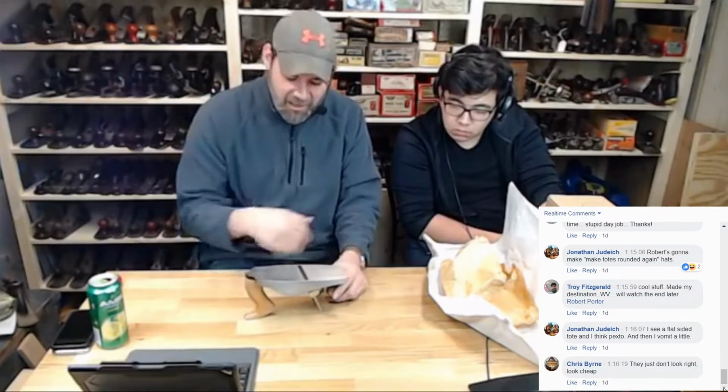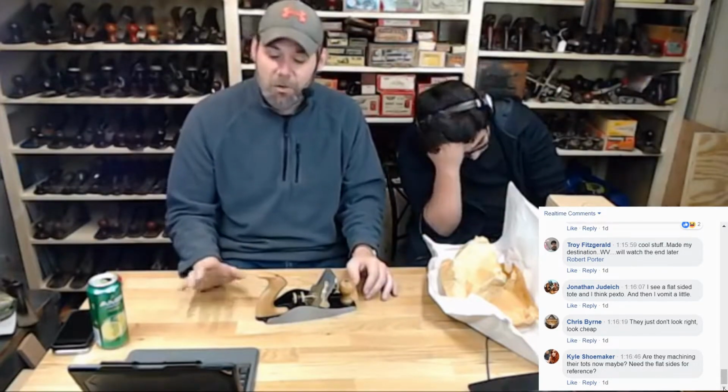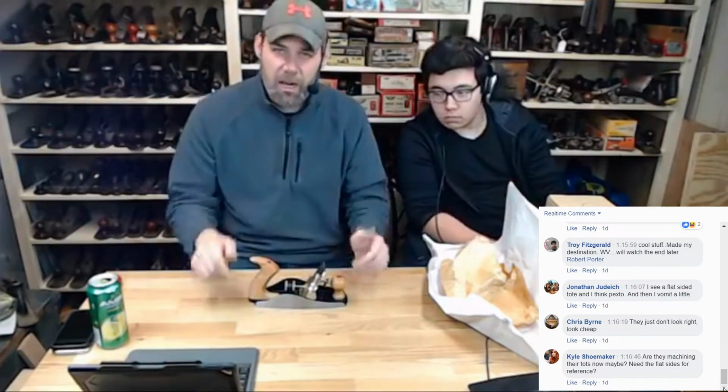That's funny, John. Yeah, I do vomit a little bit too when I see that. I'm looking forward to using this. A lot of guys see 112s as useless tools. No, they're not. They work really well. You've got a funky grain to deal with, something that's interlocking, crossing itself. You can't plane it. Low angle, tooth, it doesn't matter. You really can't plane it. There are some infills out there that might be able to tackle the job. Break this out, and honestly, just get it done. Nice and smooth. Nice and simple. So, nice quality.